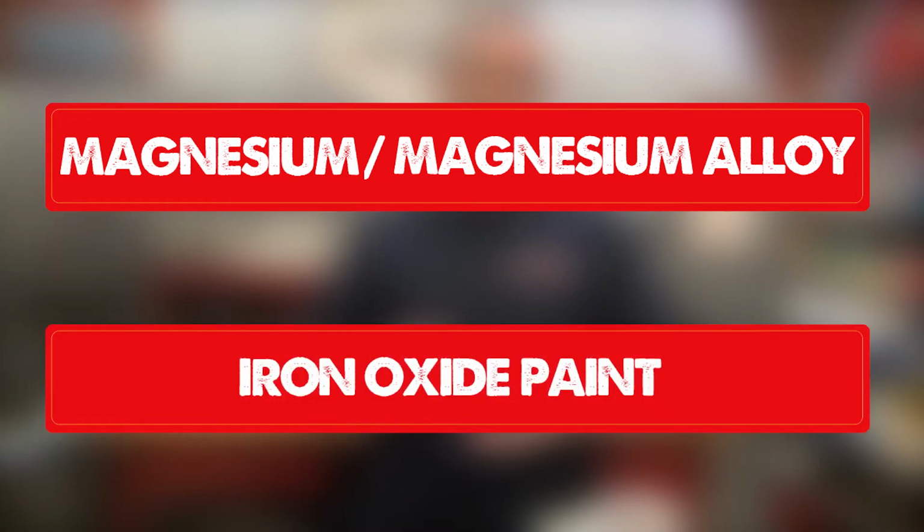However, there are a few exceptions. Metal Rescue is not safe on magnesium or magnesium alloys. Also, because Metal Rescue removes iron oxide, paints that contain iron oxide may be affected or removed. If you're unsure if the paint on your part contains iron oxide, test a small area first before soaking the whole part in the solution.